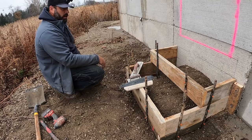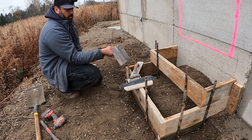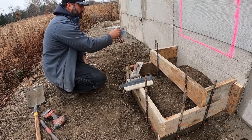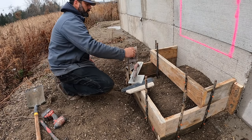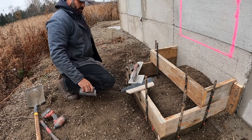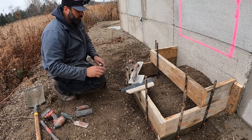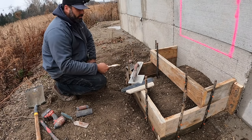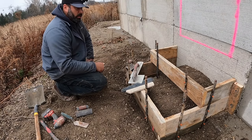There are also a few tools that are nice to have but not completely necessary. This is an outside nose tool - we call them inside and outside step tools. The outside step tool is used on all outside corners. The inside cove tool is used where the vertical face meets the first tread to make that area look really pretty. A margin trowel is nice for getting into all the little corners, and a paintbrush is really nice for all those detailed areas when you're doing the final brushing. These really put the finishing touches on a set of steps.